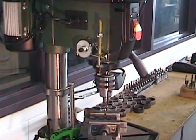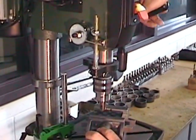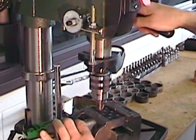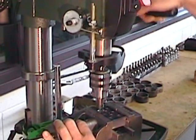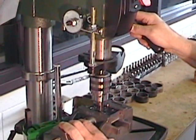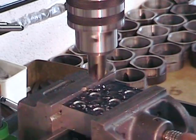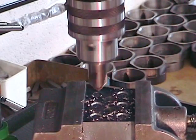This technique will give us an even depth of chamfer on all the 8.5 holes, but if we apply the same logic to the 11 millimeter holes, they'll end up with the same depth of chamfer as well. In other words, all our holes, regardless of their diameter, will have a 1/2 turn depth of chamfer. And when all the holes, regardless of their diameter, have the same depth of chamfer, well, our part looks pretty good. Complete the six chamfers on the 8.5 millimeter holes.